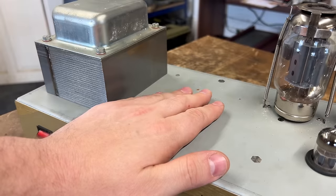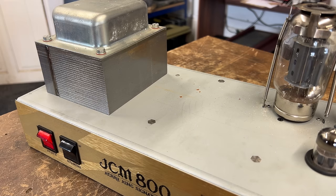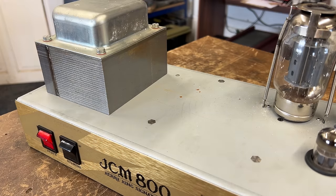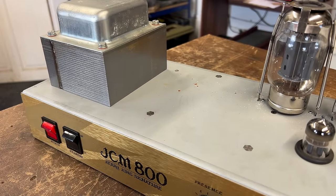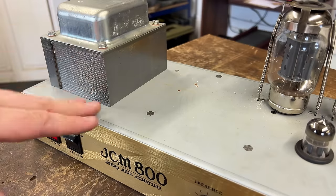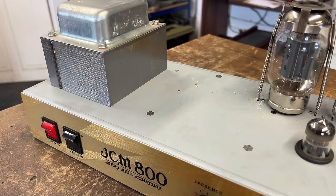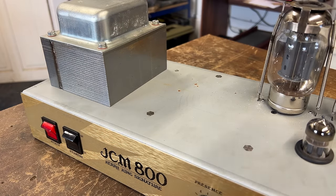He's only just bought this amplifier and has only tried it at home, so it could be an issue at his place. Under my testing I am unable to replicate it. Some of you who know Marshalls — the old DSL and TSL series did have issues with mains transformers buzzing, where the laminations start to work loose and vibrate. The quick fix is to re-tighten the bolt down, but over time it gets too bad and you have to replace the unit. Maybe that was happening here — I don't know. I've tried everything to get this amplifier to play up in the way he described, and I can't.